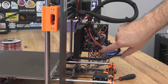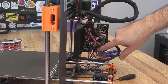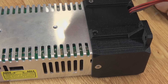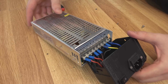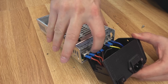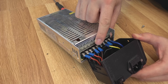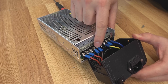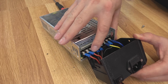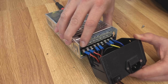With these connectors, that's the biggest issue I see on these boards — they get burned up, and that's caused by loose connections. So double, triple check that. I'm just going to take the cover off of the PSU so we can inspect these wires even further. You don't necessarily have to take the whole cover off since you do have your AC side wires over here for your receptacle, but inspect these at the very least. I'm going to go ahead and replace them because these are the original wires for this printer, and I'm going to move up to 14 gauge wire. I can draw around 20 amps on one set of these with that heat bed — this is 12 volt, and if you get some extra resistance there could be issues. Having the larger gauge wire could help.